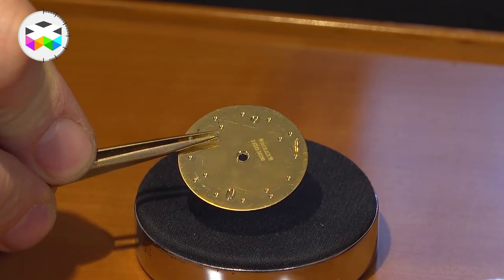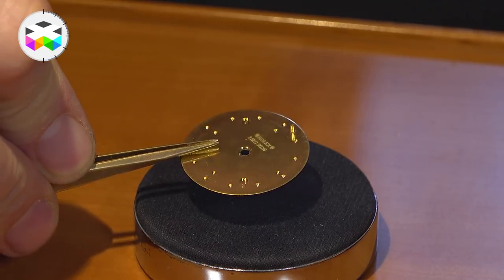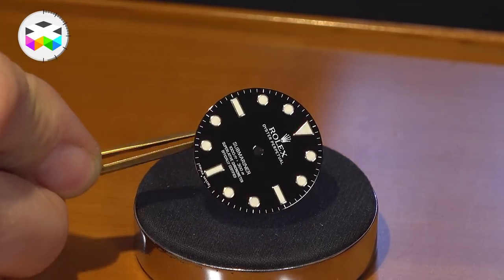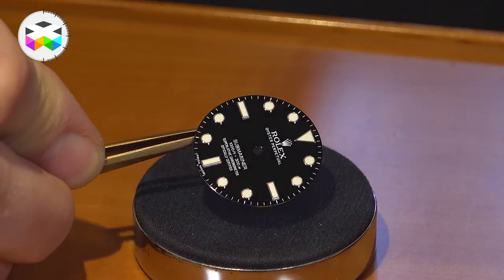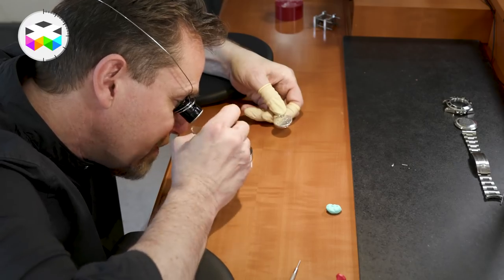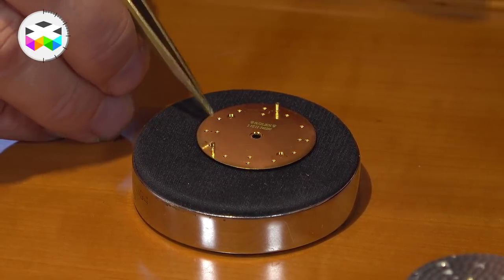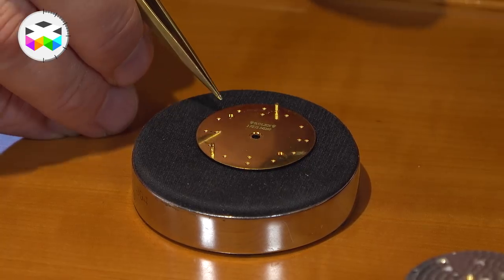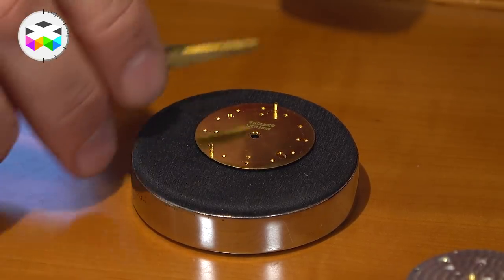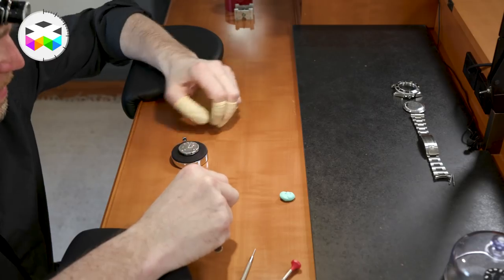You see the bare metal of the underside. You have the references again — Rolex and the reference in relation to the dial. All of the little millings inside of the dial are the backs of all the indexes placed onto the dial. They are all milled down. The indexes have two or three feet which are then pinned into the dial, and then each one is riveted with a pyramid-ended punch to ensure it never moves. So all mechanical — no brazing, no cement used. It's made for life.